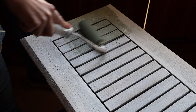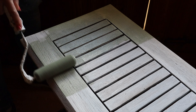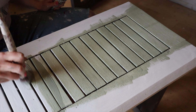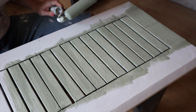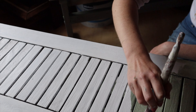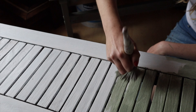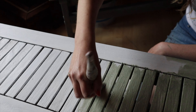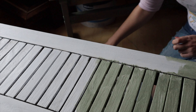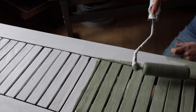If you're going for a completely brand new feel for your renovated patio furniture, you might want to use some wood filler on any of the larger cracks or gaps. Personally I'm giving this patio set another lease of life rather than trying to make it look brand new. You are potentially causing yourself more work — more layers of paint needed — when you do a coat of primer, because in this case I'm starting from white which is the hardest colour to cover. Going on top of the original grey if it was in good condition would have got me to that darker, more solid green much quicker and probably would have needed a coat fewer.